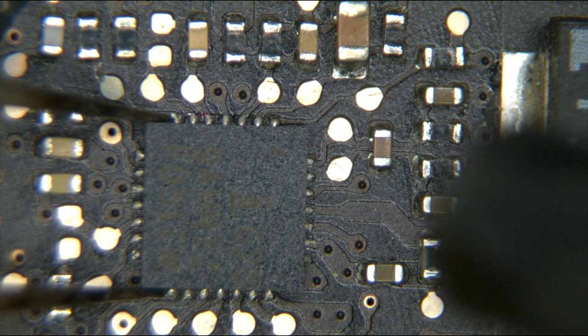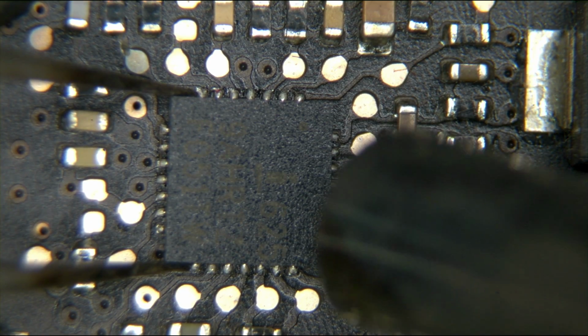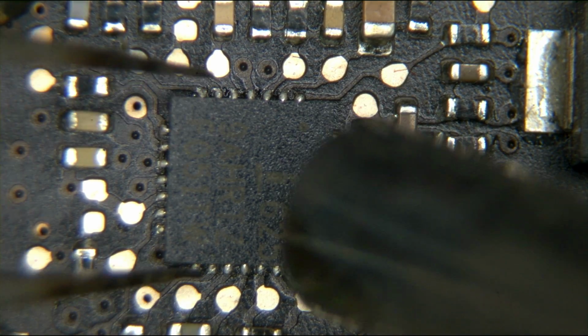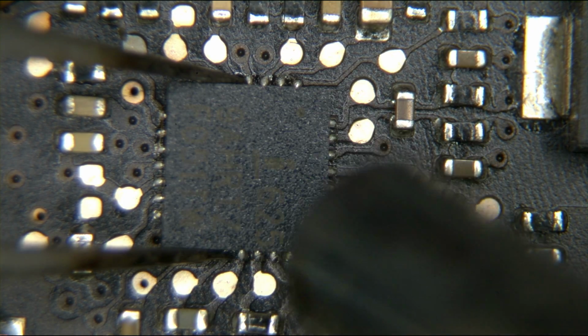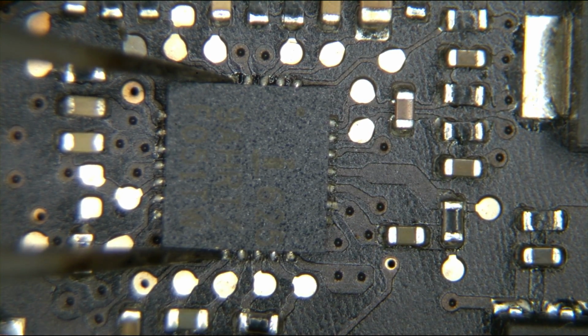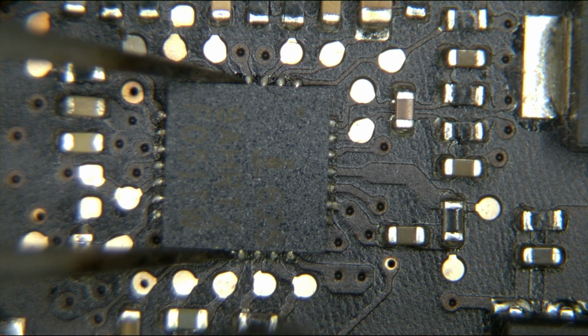Now, as I've said in the last video, I believe my FR801 needs a heating element replaced. Because I'm on 8 right now. If any of you who have an FR801 know, 8 is way too high for this work. It's really not what you should be using, and I'm still not melting a thing. I've got the airflow on 12. Usually I'm doing this at 6.5 or 6.